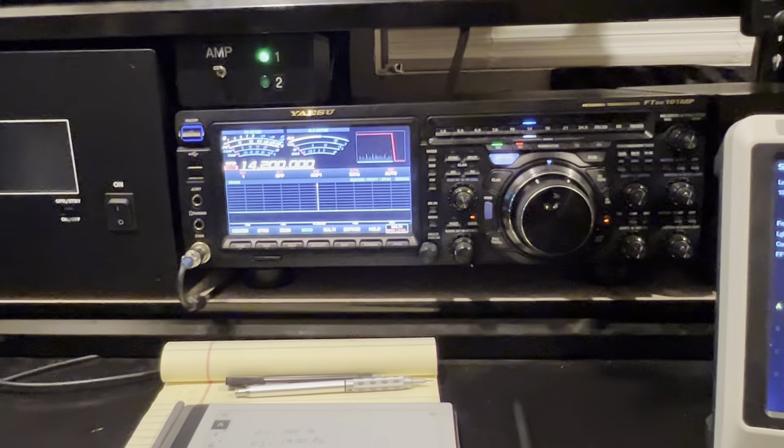Let's go back to trace, clear right, and transmit again. Now I'm going to increase the power and watch what happens to the IMD. We'll try to find worst case. We're at 202 watts now — full output. Let's go to average. Stop transmitting. We're showing minus 34.6 dB for IM3 and minus 40.9 dB for IM5. That's dBc — that's different than what ARRL does, which I'll explain in a minute.